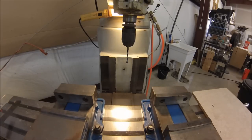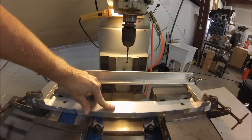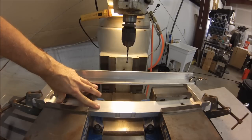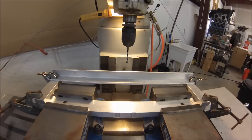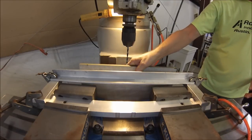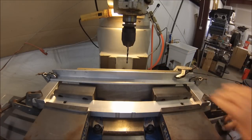Now please bear in mind, I put this rig together in about 10 minutes, because in a job shop, time is money, and I didn't feel like waiting around all day. Piece of 1 by 2 stock, about 2 feet long, 3¼ by 2 bars on the end, 3 inch cant twist clamps holding it down, piece of 1¼ inch 90-degree stock on the end — nice and rigid. Now, the part's going to hang there — how are we going to straighten it out? Take a couple of 1-2-3 blocks and put them right on the ways of the machine. Look at that — how sweet is that?